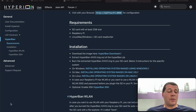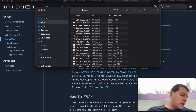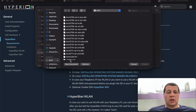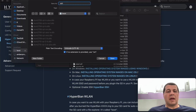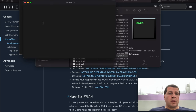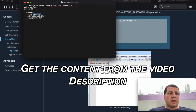This is how you configure the Raspberry Pi Wi-Fi and enable SSH — you just need to create two files on the Micro SD card. After Balena Etcher finishes, open your Finder or file explorer, unplug and plug the SD card back in to see it, enter the boot partition of the SD card, and create two files inside. One will be called SSH — a new document with the name SSH without any extension. This is needed to connect to your Raspberry Pi over SSH. The second file will have the following content and is needed to connect your Raspberry Pi to your Wi-Fi.